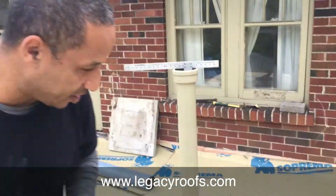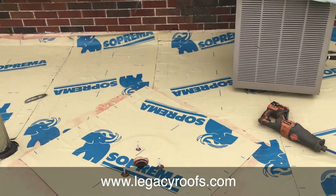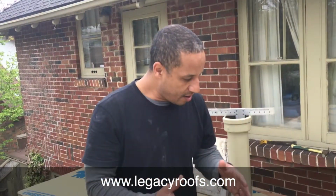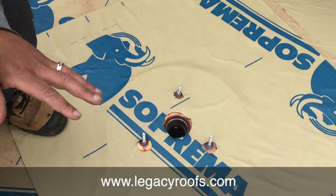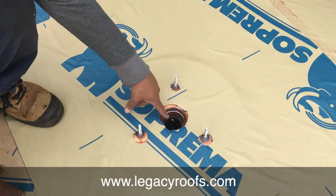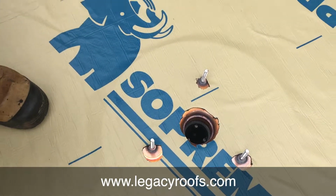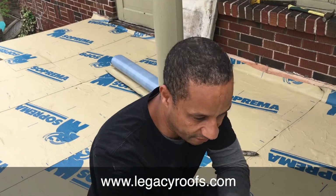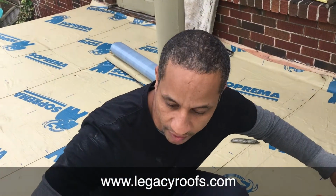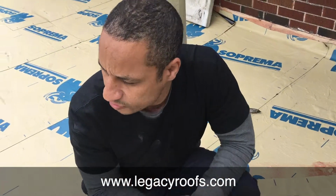Okay, welcome back. We finished tapering the roof, adding the new substrate. You can see we put the base sheet in place. It's a fully adhered system. It's typically what we go with for residential roofing. We've added a new drain insert. And because we are retrofitting a drain, we've added a U-flow connector inside. Because it's two different connections, the insert now has a compression underneath, so water can never back up into the owner's house. If he has a plumbing issue, it'll back up on the roof and eventually drain. So there we go. We flashed the perimeter wall and the outside. We will start putting some cap sheet on, and away we go.